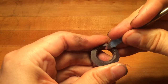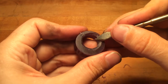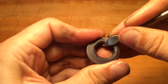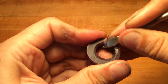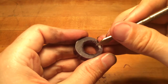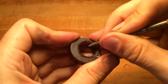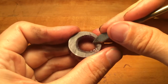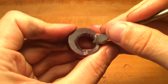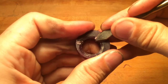Apply smooth and even pressure, and going slow is important. I automate it in the sense that I hold the blade steady and I rotate the wax — I'm actually pushing the wax in a circle rather than getting my wrist to do a really hard motion. Generally when you're shaving, you hold your wax steady and move the tool. But when you're trying to cut, I rotate my wax while I hold my tool steady. If you're left-hand dominant, it's the same principle — it's just going to look mirrored.